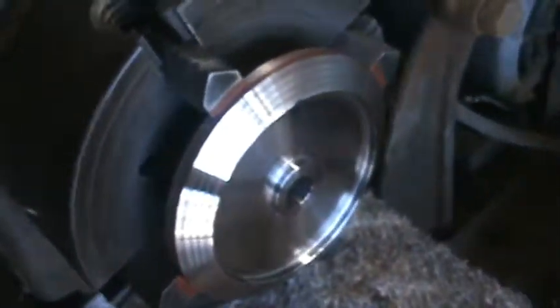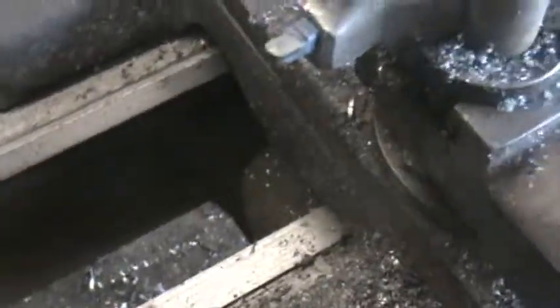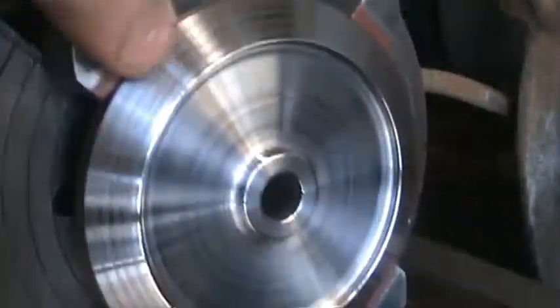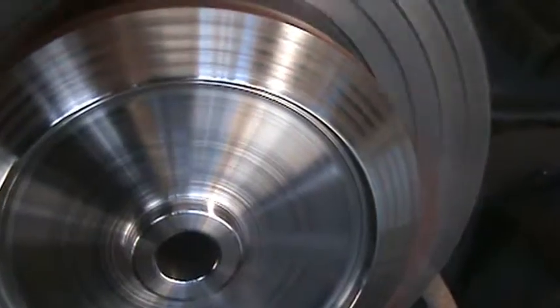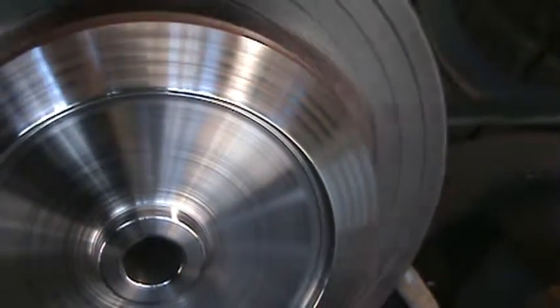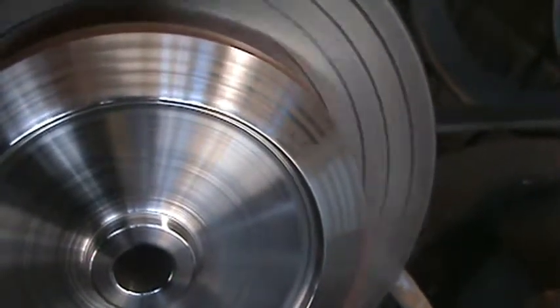All this has led to here. I'm making a new flywheel for the gyroscope. We had it balancing, but it's still anemic, and I want something with some chunk to it. I think I got it. I switched over to some of these cheapo carbide things and they're leaving a pretty nice finish. Put the hole right at the edge of the frame — maybe you'll see the runout. I can see the runout. On that hole, I didn't have it wind up when I flipped it over in the chuck.